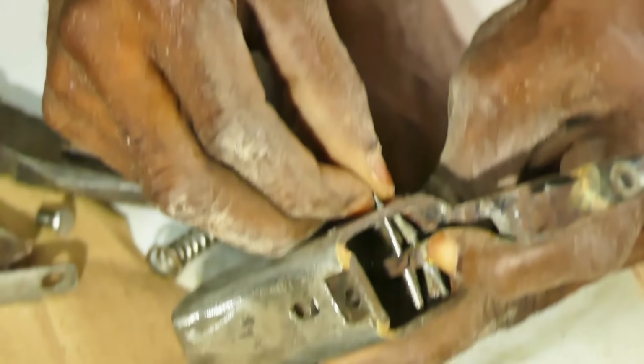I am very happy that we are finally being able to get the shotgun successfully firing multiple consecutive shots. We are getting good, strong primer strikes, but no primer blowout, and no swelling, solid performance. I look forward to going to fire this shotgun myself very soon.